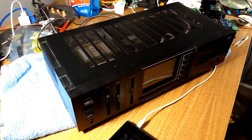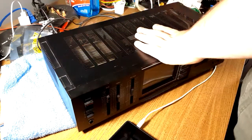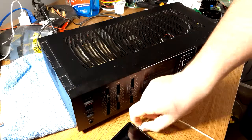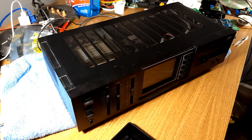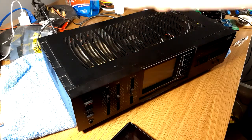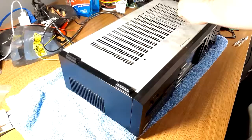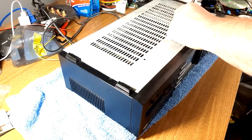You should notice most amps of these types are not 4-ohm stable. This amp is barely 8-ohm stable. Put a 4-ohm load to it and it'll catch on fire. When we flip it over you'll get to see why. I've not been inside this thing in a couple of years.